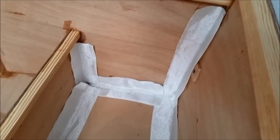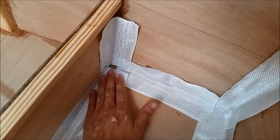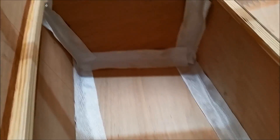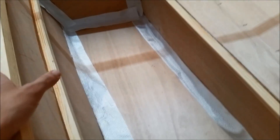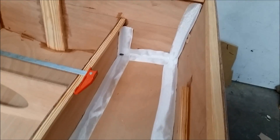I've made pieces for all the edges anywhere where plywood meets plywood at approximately a 90 degree angle. It's not too critical how the overlaps work — as long as you end up with everything covered. In most cases I wasn't even using a tape measure, I was just eyeballing the length. If in doubt, just give it a piece of fiberglass — you're not going to screw it up. I've got to do two sides, so if you wanted to you could go ahead and cut all the pieces for the other bay since they're identical, or just do it one bay at a time to break up the work. This part is probably the most boring part of building the boat — doing all the taping.